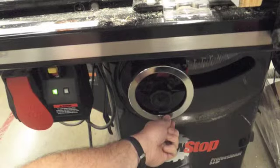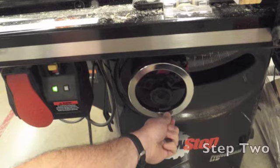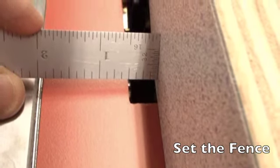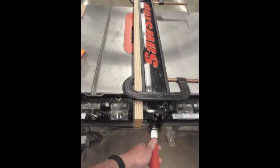You'll raise and lower the dado saw blade by turning the front wheel clockwise or counterclockwise to lower it. Step 2 is going to be setting up the fence. A portion of the blade is going to be what's called buried into the fence, which means for this setup only about a half inch of the blade should be exposed. Just like our other table saws, to adjust the fence you're going to have to unlock the knob and when done lock it back in place.